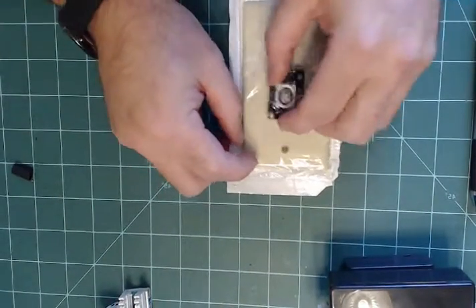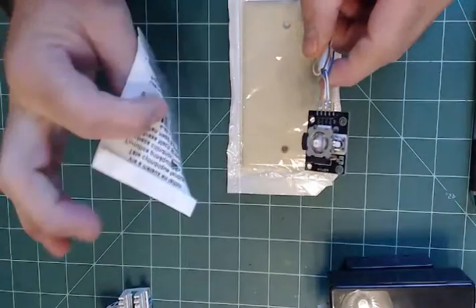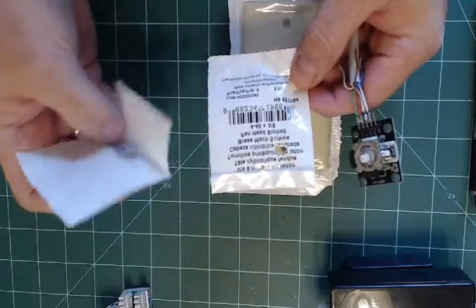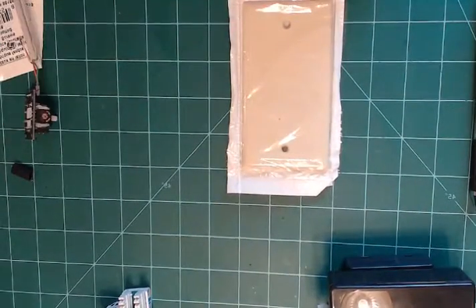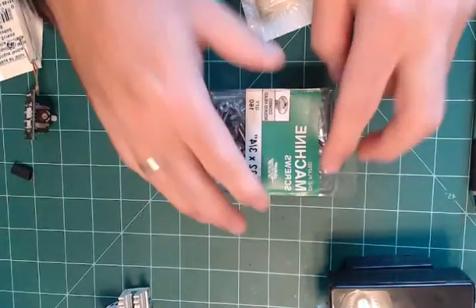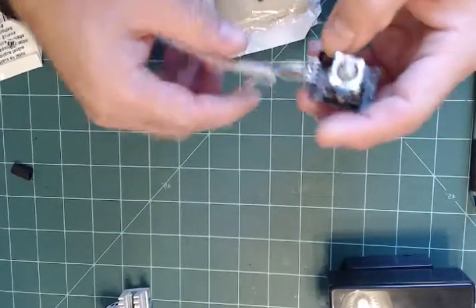Something important: these circuit board mounting holes are designed for number 4 bolts. I had to go to the hardware store and get 4-40 screws, three-eighths inch long, with matching nuts. For everything else in the project I use number 6 bolts — I buy them in bulk since they're much cheaper. The three-quarter-inch number 6 nuts and bolts work for the enclosures. But when dealing with circuit boards, you need number 4 — now you know.